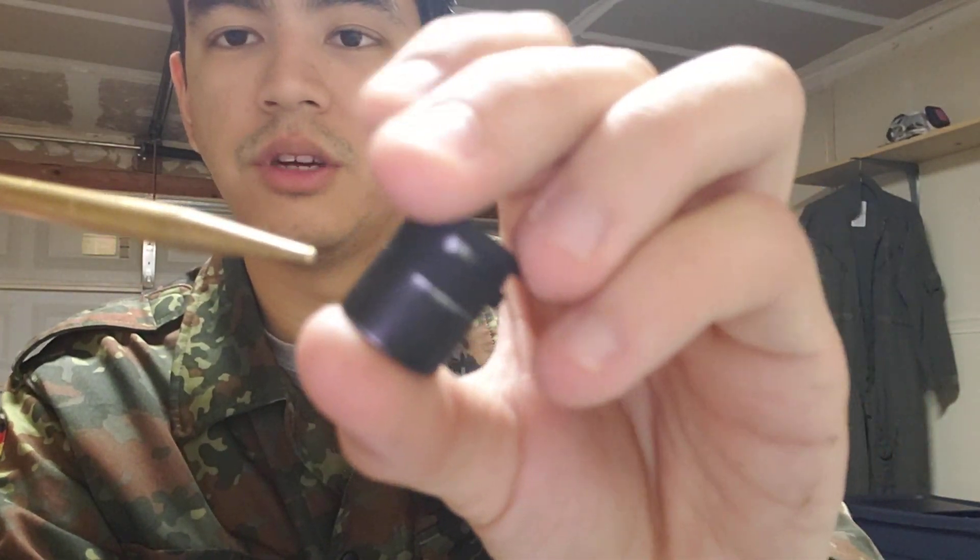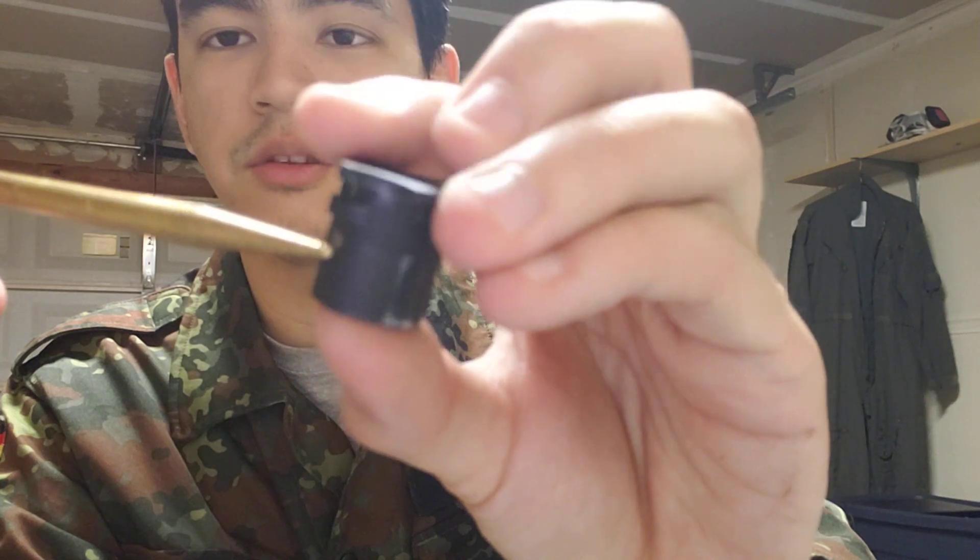The muzzle cap isn't really a high-stress part anyway, so nothing to report there. The barrel bushing is a very important part for this gun — you can see the usual wear patterns all the way around in all the usual spots I'd expect to see, with no chunks of metal missing or anything extreme.